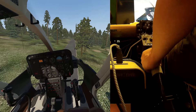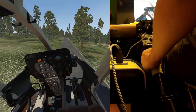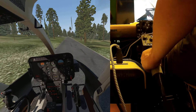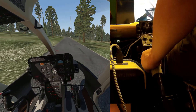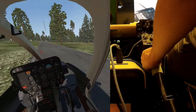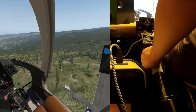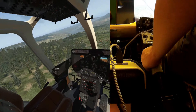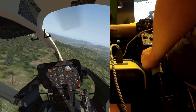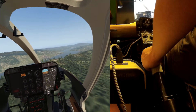The lever felt a bit wobbly, so I thought it might be a good moment to redesign the lever body. The recent bodies all have about 200 degree throttle grip range, which is realistic according to my friend who is an aerial pilot on the Bell 206. This range allowed me to fit two strengthening M4 screws into the lever body instead of one. The original body was designed around the standard 16K potentiometer range of 300 degrees, but I've been able to reduce the angle without losing too much precision. With two screws instead of one and a redesigned throttle frame with housing connectors, the new body is rock solid and much stronger than before. I've been testing it with the VR Max head for around two and a half weeks now and the body holds like rock — the head weighs nothing and the friction tensioner also works great with it.